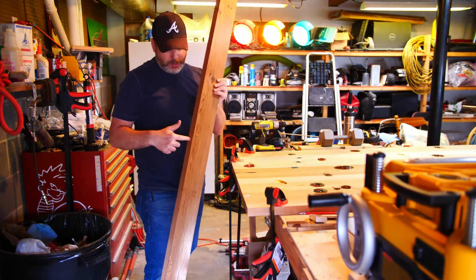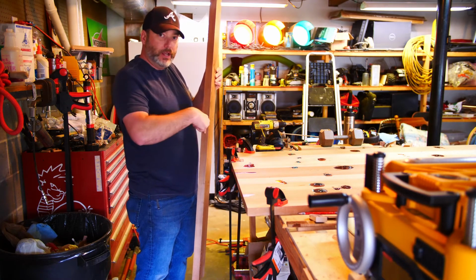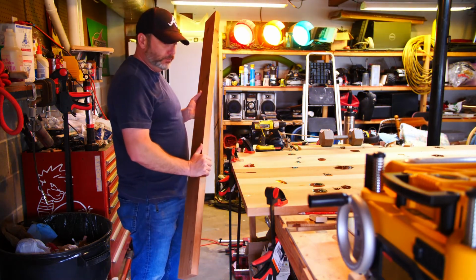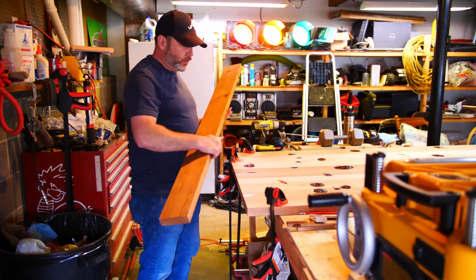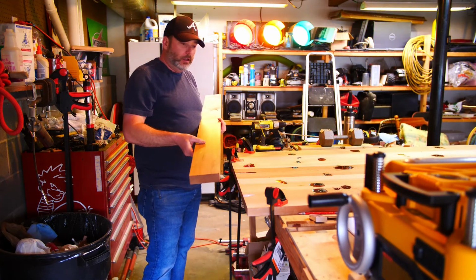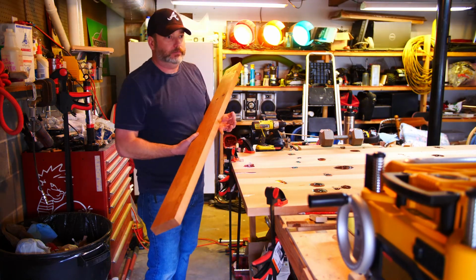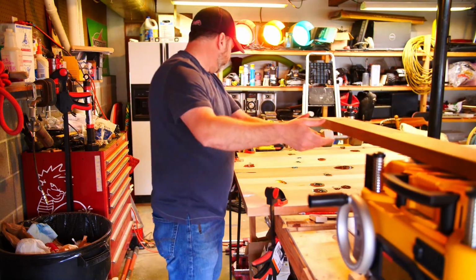because you want it to be 90 degrees, then you're going to oblong it this way for these boards to have movement with humidity changes side to side. But you don't want up and down slop, because then your board's going to be sloppy. You don't want that. So, all right, I'm going to give the old drill a workout.